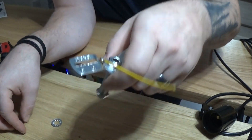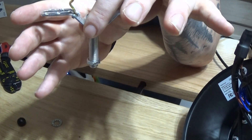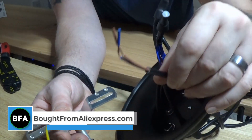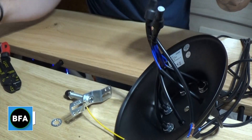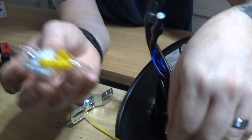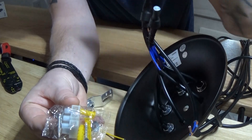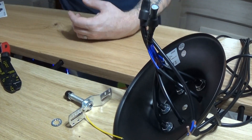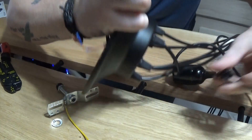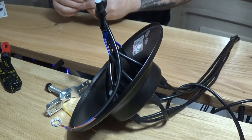Once we've done that it's time to attach it to our ceiling. To do that we have this bracket with our earthing wire. This bracket will attach to the ceiling, this base will slide over it all, and this little nut will keep it in place. These two wires are going to attach to your mains along with this earthing wire via this connector block. All the fixtures and fittings are in here — these are for these brackets to attach them to the ceiling.